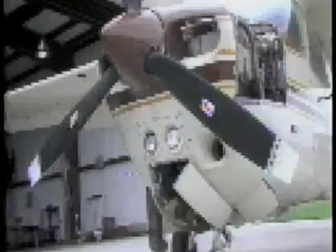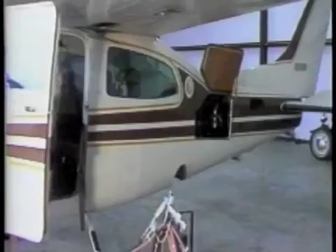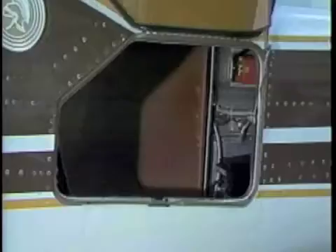Now let's turn our attention to the actual use of the system on aircraft. We've prepared our aircraft beforehand, anticipating a shooting scheme for the Corrosion X process. You can also save time by preparing the aircraft before actual spraying by opening cockpit doors, removing access plates, wingtips, and engine cowling, lowering flaps, and developing a strategy or shooting sequence to save time and energy.